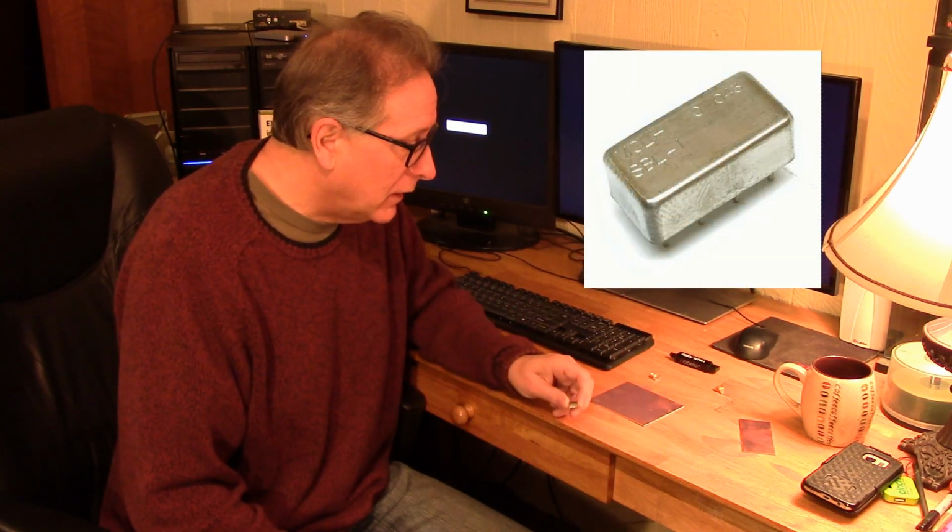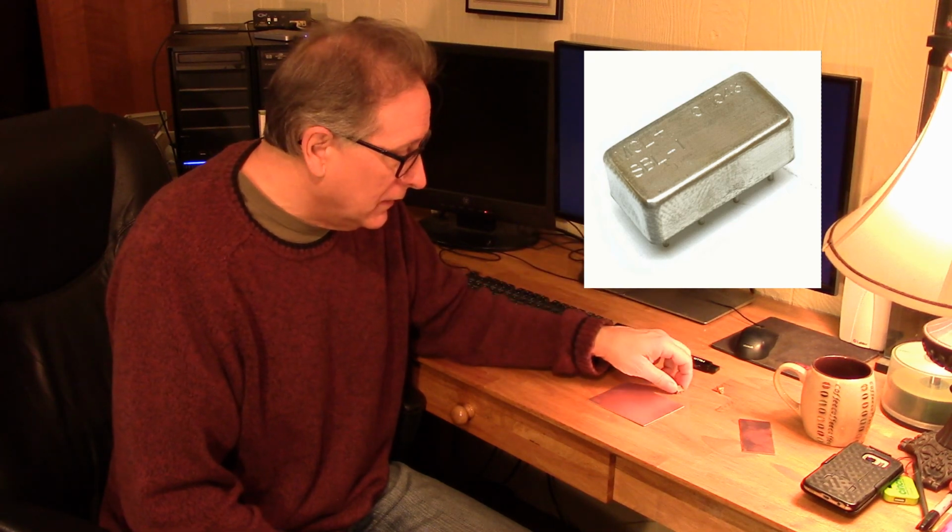So we'll go through the pros and cons of the converters, the filters that are necessary, the strength of the mixer that is required to get good performance, and we'll handle the pre and the post filtering and amplification, as well as the termination on the mixer ports. I am going to start with a passive mixer, a diode mixer. So enjoy this video series on converting your dongle.